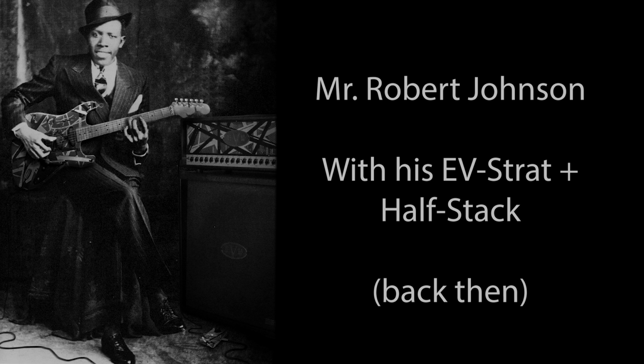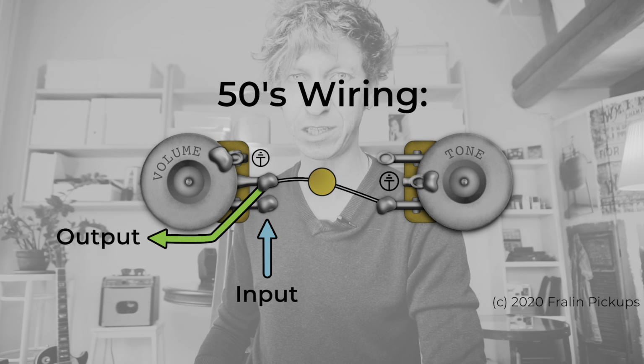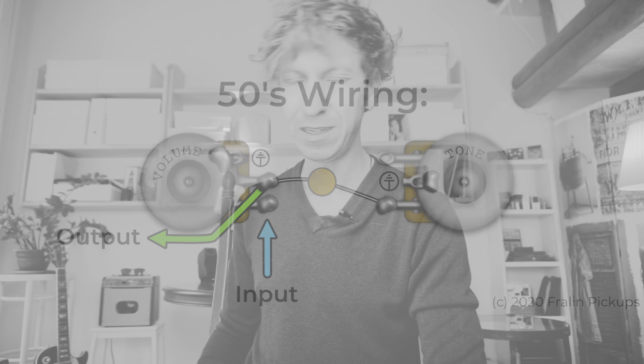Still, many guitarists, many purists like ourselves, prefer this 50s style wiring in their guitars because it gives the guitar a slightly fresher tone, so to say. And because the tone control sits at the output of the volume control, it also interferes a little bit less with the signal when not engaged. Because flipping the circuit between 50s style wiring and modern style wiring is such an easy modification, you can do this yourself with some basic soldering skills to experiment with the differences in tone. Many modern guitars come with 50s wiring style.